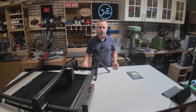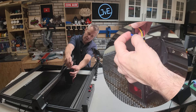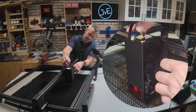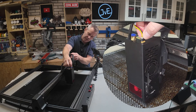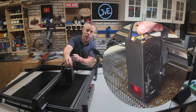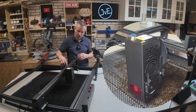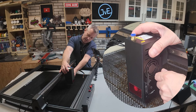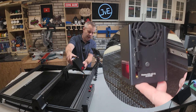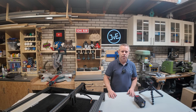The first step is removing the laser module. Press down the blue ring and pull the air assist hose out of the connector. Then remove the power connector from the laser by pulling it up on the connector itself. Don't pull the wires, only the connector, and it will come loose. Next step is to release the latch which secures the laser module and just slide it out gently in the upright position. Now that we have removed the laser module, it's time to start the cleaning.